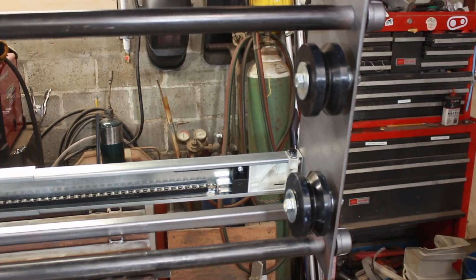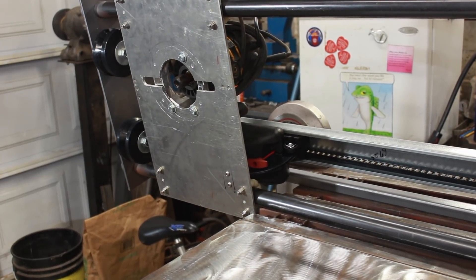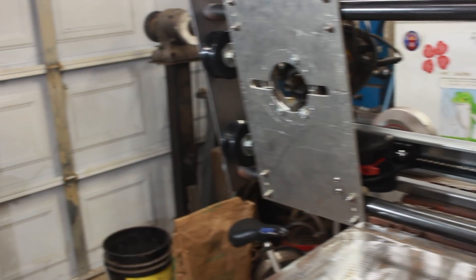These rollers are going to slide along an angle iron rail on the top of the table this whole thing sits on. The drive is in there, all hooked up and wired in — what I don't have yet is the control strategy. One of the remaining things is to put a box on the end to house the power supply for this 24-volt motor and the 9-volt Arduino microcontroller that's going to run it. The microcontroller will sense when the drive reaches one end and reverse direction, then do the same at the other end. Anytime the router has power it will automatically go back and forth.